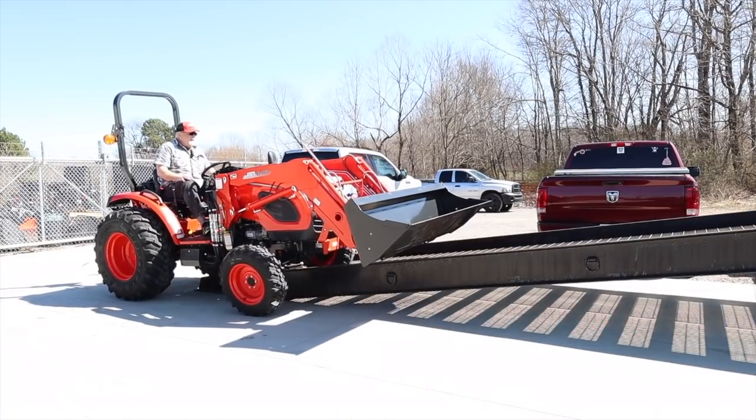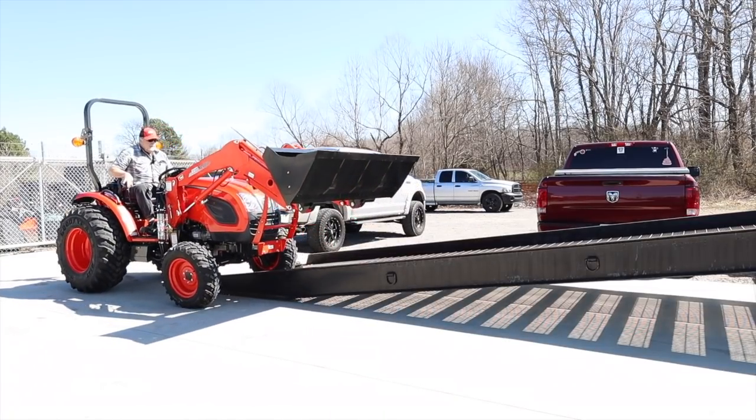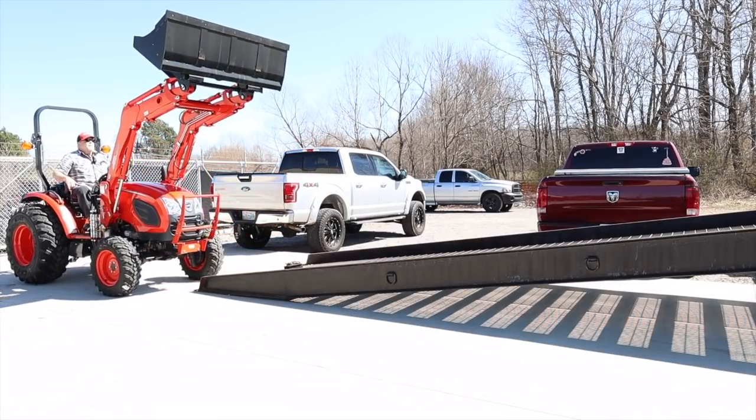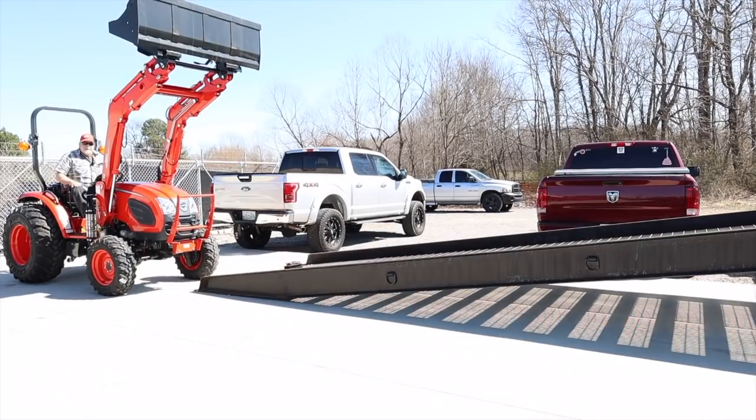That 1,835 pounds is under the best possible scenario — right here, not even moving. This is the only place I'm confident that the loader, maxed out at capacity, the tractor will not roll. Anything changes from here — including driving — lighten your load. Take two scoops. That number is for comparison, not for actual capability. Hopefully you can understand the difference between what I'm saying about the rating versus real-world use.